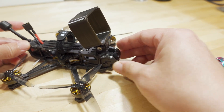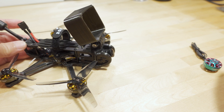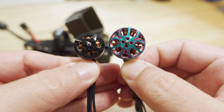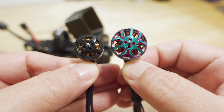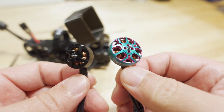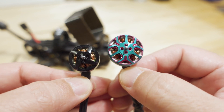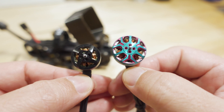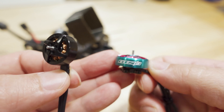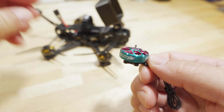If you're looking for a motor that's going to give you a little more authority in flight performance over a 1404, the 1804 is a good option without adding too much extra weight. It depends on what your build is and what your goals are. In terms of weight penalty, it's not a whole lot. But if you're looking for freestyle performance, I would not choose this motor — I would choose a 1506 instead. For cinematic flying and efficiency, this is fine.